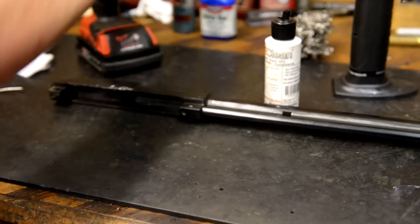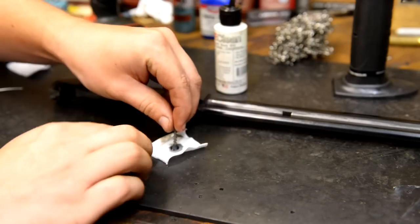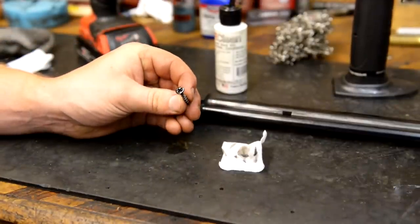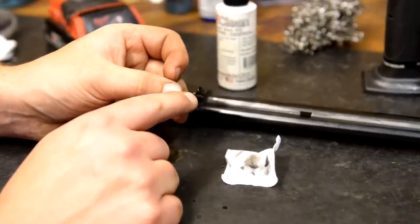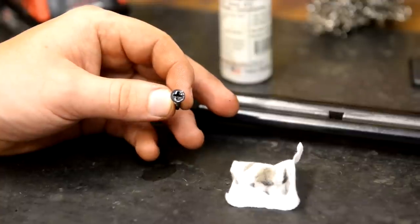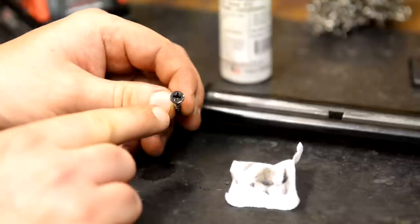What we'll do is I'm going to show you the screw that we did. With the screw head, we're just going to grab a little bit of oil and dip it in some oil like this, kind of wipe it a little bit. And see, there's our screw head that we reblued. You've got a nice dark blue color — you can see the shaft of the screw is still in the white. The 4440 gave us a nice, rich, dark blue. That would do just fine for a recoil pad screw or an action screw, or really any kind of screw where you've damaged the screw head and you've had to file it or mill it down and you need to reblue it. That's a perfectly usable example of what you would expect to get out of something like a cold blue product.